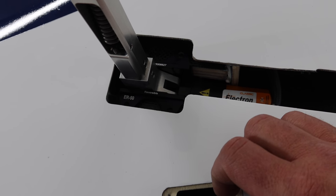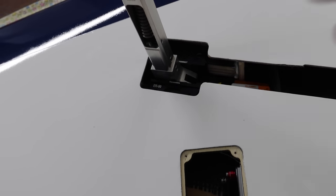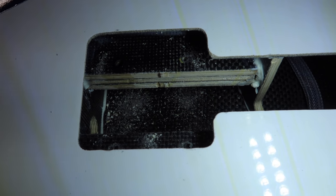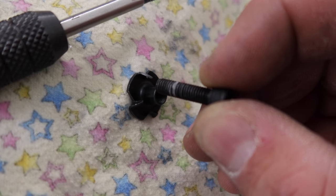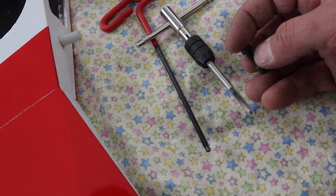For this gear I'm going to use blind nuts just like we did on the front gear, but I've opted against that. The reason is we've got three layers of three-eighths or quarter-inch ply and we'd only be grabbing about half the blind nut, which isn't very good. So what I'm going to do is what I usually do — drill and tap the plywood.